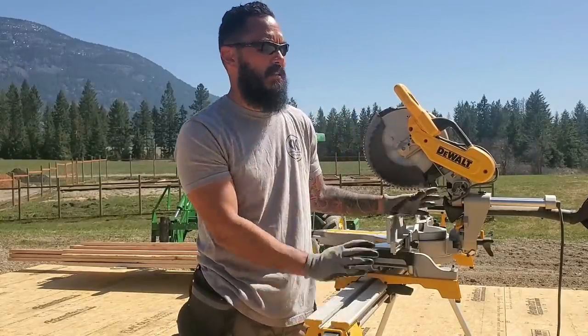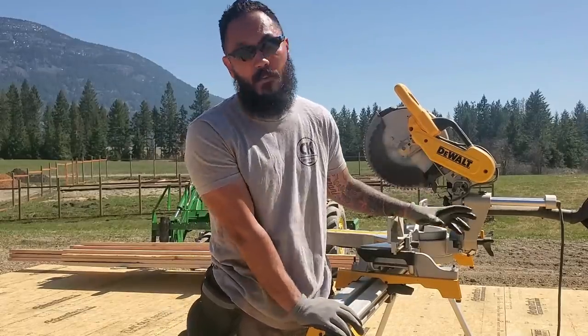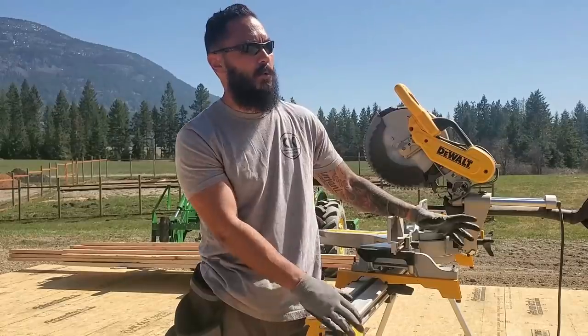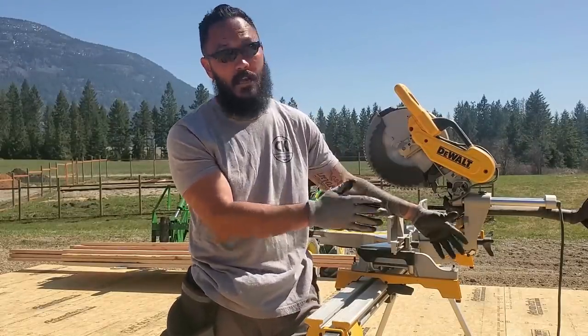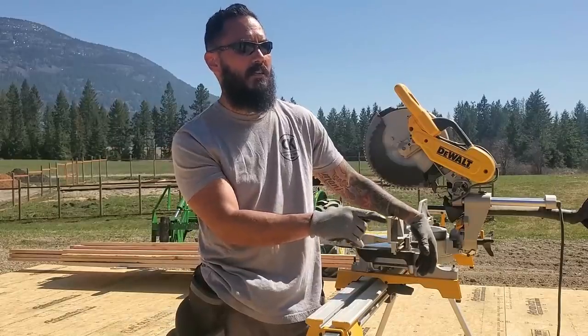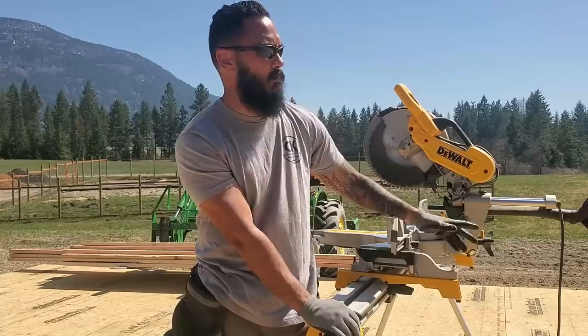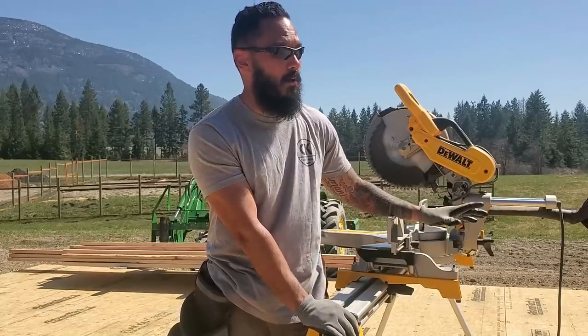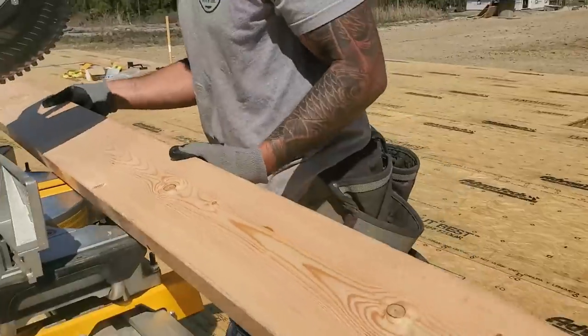We need to do the remainder in two sections because we are framing out the master bathroom and we have two windows that are going in there. So we want to make sure we have a break in the wall that allows us to get those two windows framed on the same wall. The first section is going to be an 8 foot span that just has a stud set up on 16 inch centers. And we'll wrap up the framing for the back wall in our master bathroom. We'll stand those up and get everything put in place once we're done with the sheathing.